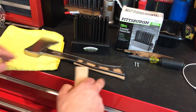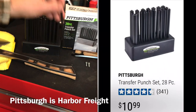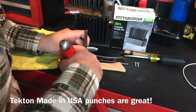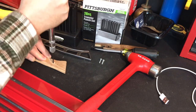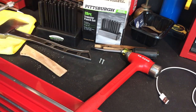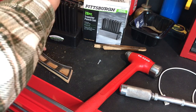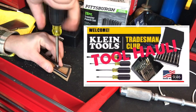To mount them I used a transfer punch — I got those from Pittsburgh, they seem to work pretty well. The reviews on them were really good. You just don't want to wail on those — just make your mark and then use a regular center punch. Then the good old Stanley push drill — love when I have an opportunity to use this. It makes such quick work of it and you have great control. Once you grind it to the exact size in position, you can just finish those holes all the way through on the drill press.